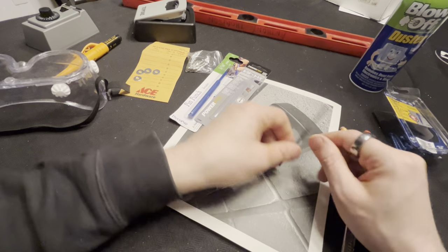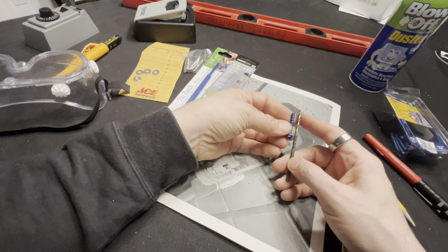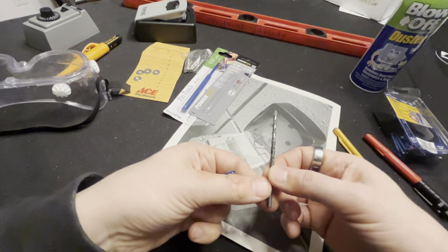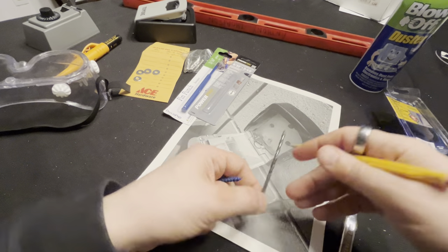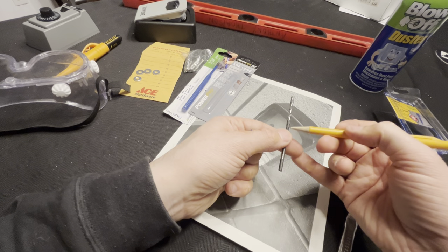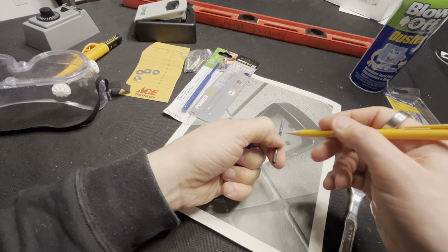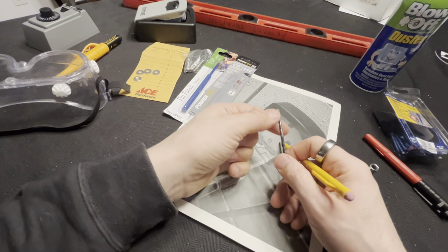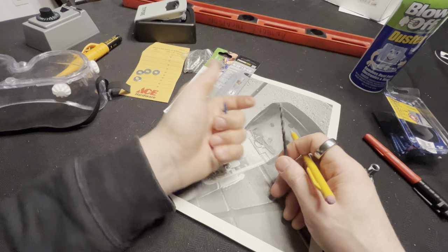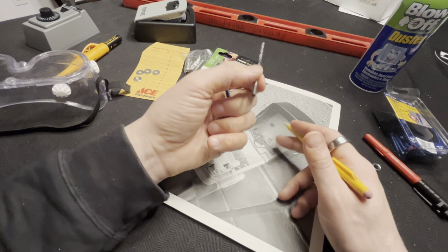You should mark how far you want to go in — drilling 101. You want to go in slightly longer than the length of your fastener, your Tapcon or whatever. The poor man's method is you wrap a piece of painter's tape around the drill bit where you want to stop, then drill until the tape is flapping at the surface. I opened a bucket of various tapes and picked the oldest one — it was so old it didn't stick, it just flaked off. So that caused some more swearing.